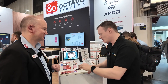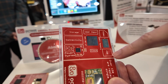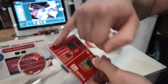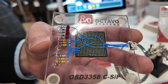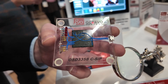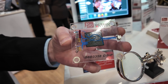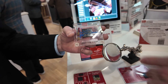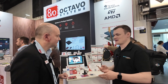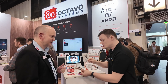Just to be clear to the audience: you can basically wire this thing up with a bunch of wires in the back and get it working — USB is just a USB connected directly to the chip, video is a direct connection to a video port, same with connectivity and storage. Here's a great example where we dead-bugged the AM335 processor with high-speed memory and eMMC integrated, wired up USB and power, and were able to run a full Linux computer just from the dead-bug. That demonstrates how much power this thing has and yet how simple it is to use.